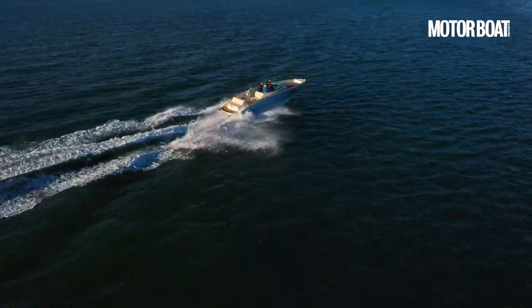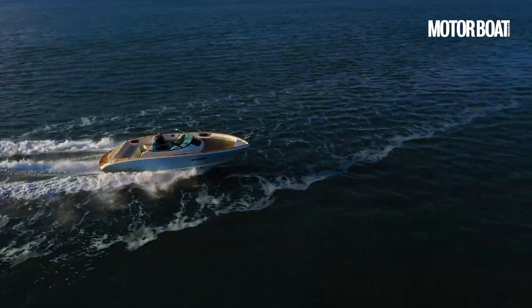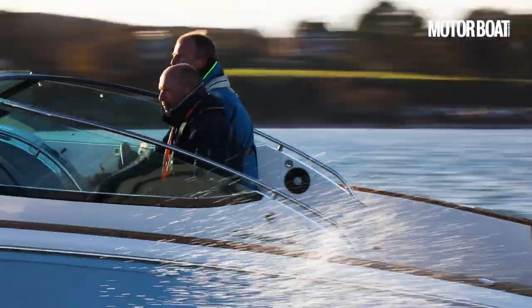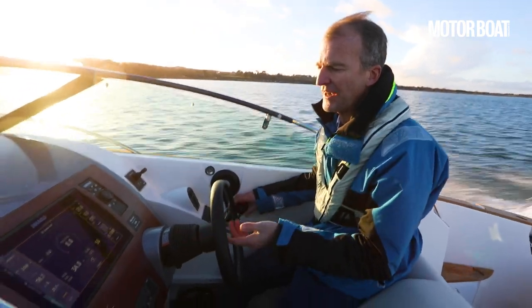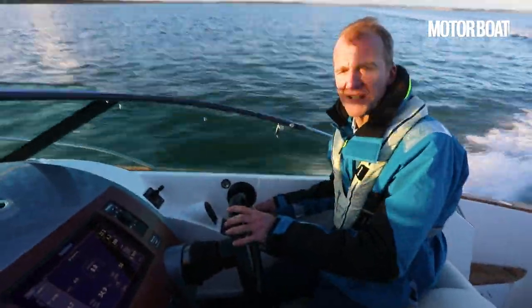The other advantage of a really smooth-running hull is that it's actually pretty efficient at lower speed. At 27 knots we're burning 38 litres an hour — not much more than a litre per mile, which on a really quick boat like this is pretty impressive. It does need to be running at about this speed to feel good; any slower and it starts to drag a little. At 25 knots, just over 3,100 rpm, we're using 33 litres an hour — you're not really saving much on fuel, and it actually feels better when running a bit quicker.